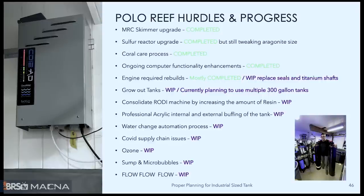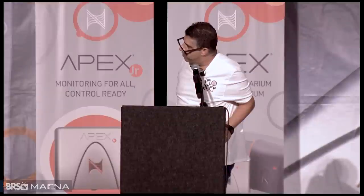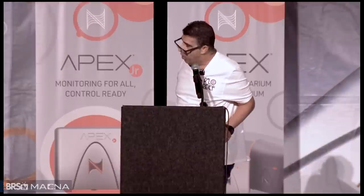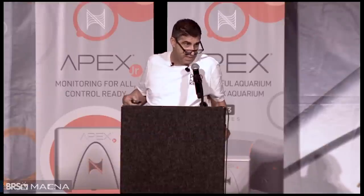Ozone, I say, is a work in progress, and the reason why is we don't know whether or not, well, let's put it this way, I can't hit my ORP set point anymore. The ozone's on 100% now, and we don't know if it's the air drying system, or the humidity in the room from the dehumidifier not working, or the sulfur reactor working with so much flow now that it's dumping a lot of negative ORP in the water. We keep the sulfur reactor negative ORP at 300-400, and so that's dumping in negative ORP. We may need more milligrams of ozone for our set point, and we're about to figure that out in the next week or two.